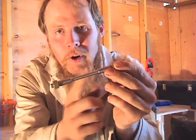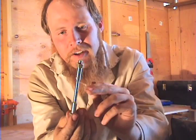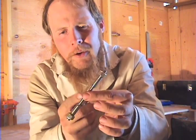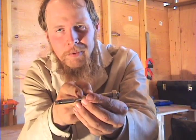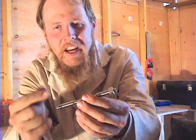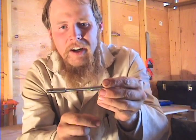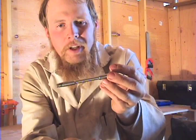This is a typical tensile specimen. It's a three-quarter inch diameter rod that's been turned down to a quarter inch diameter in the middle, so that we'll know where it's going to break and we know the area where it is going to break. The reason we do that is because we need to thread the ends so that we can put it in the machine. If we didn't have this reduced diameter region, the threads would introduce a stress concentration and would just break up there, and then the area would be very difficult to characterize. Whereas if it's turned down like this, it'll break in here somewhere — we've got a well-defined circular area and we can calculate the breaking stress pretty easily.